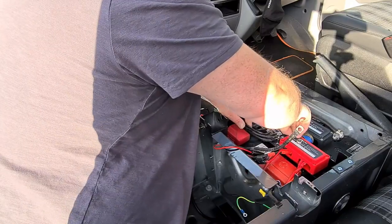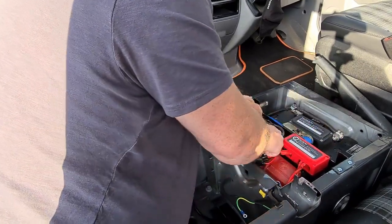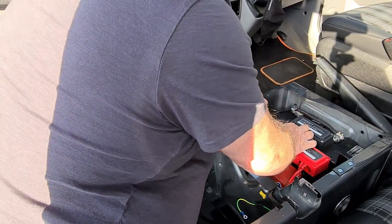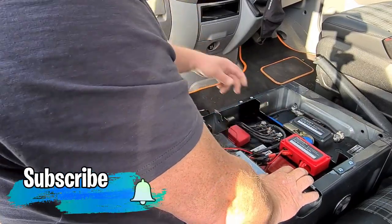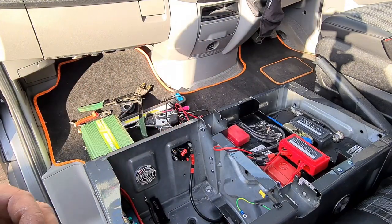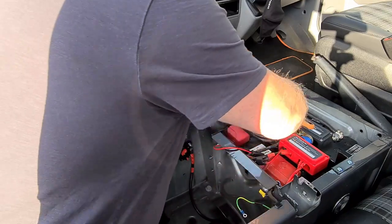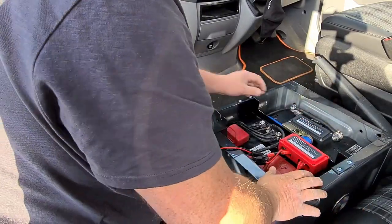Sometimes you have to make a decision on how you're going to make a connection. This earth bar is getting quite congested. So I didn't have an entry point where I wanted it and had to make the cable long enough to go around behind the terminals to the furthest point. This rail came with two 8mm studs and the rest are 6mm screwings, ideal for smaller equipment, but I could have done with a couple of bigger points. When tightening up these nuts on the bus bar, resist the temptation to go too far. Just nip it up gently with your hands and give it a little nip — that is more than enough.